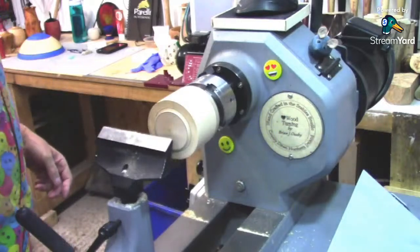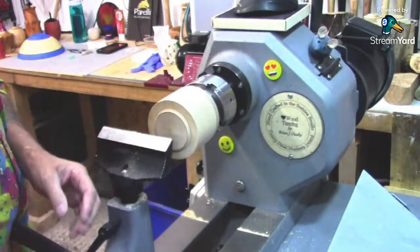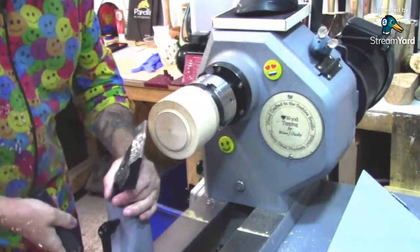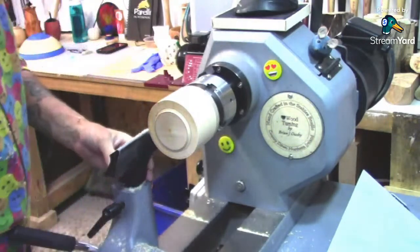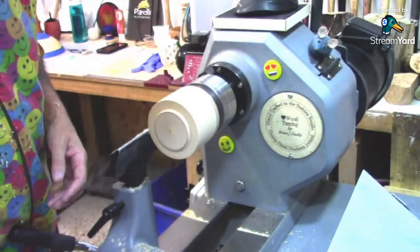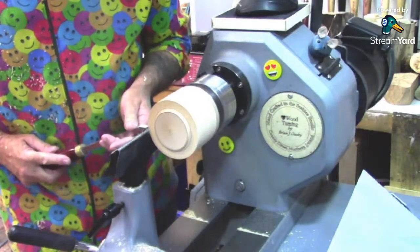Now, the depth of the rim, from the edge of the rim to the seat, is just under 5 mil. So I need another 5 mil off of this now. Oh, that's the wrong tool. Beading and parting tool, which has suddenly become one of my favourite tools.